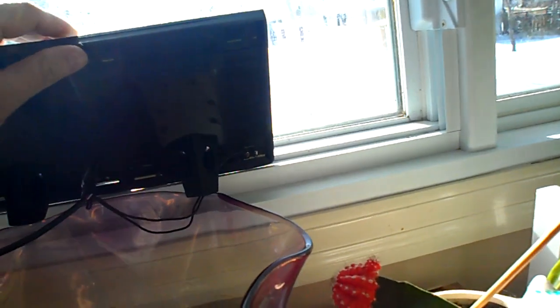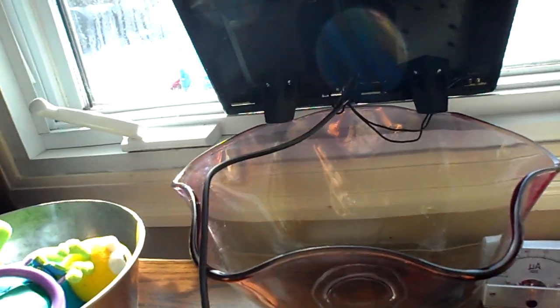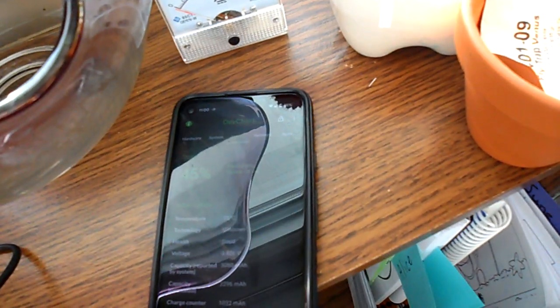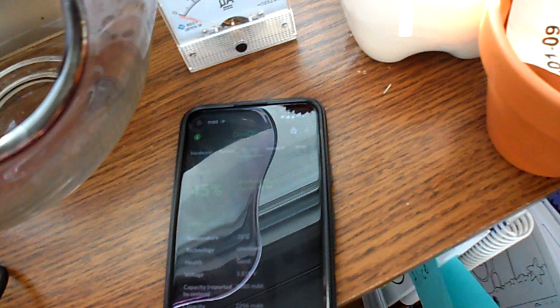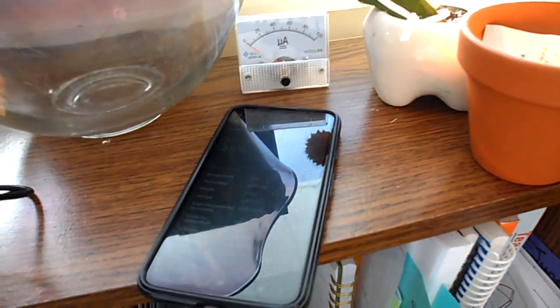I also wanted to make something a little more useful. Over here I have these two solar panels that are square panels, different in size, and I put them together in parallel. With just the phone running, you can see it's discharging - using about negative 200, negative 85 milliamps, so probably around an average of losing about 120 milliamps of current as it's running.